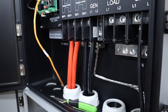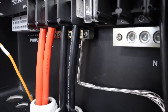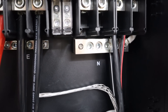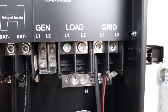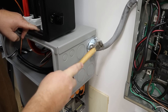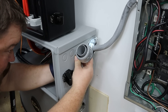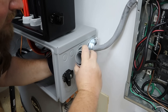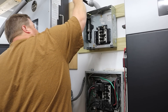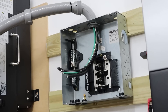Once you have that conduit box put in place you can now begin the second hardest part of this physical installation, and that is mounting the hybrid inverter on the wall. This hybrid inverter is somewhere around 150 to 160 pounds, so definitely again get some friends if you have any to help you, or use a mechanical object to help lift it up like I did. As far as connecting the inverter to the battery, you use the included cables, the included communication cable, and everything in the kit to connect them to each other. Everything is well outlined in the user manual, documented even better online, and is just easy and straightforward. Two thumbs up on Signature Solar for this install and everything you get.